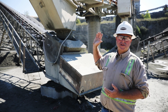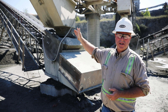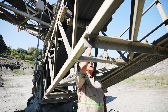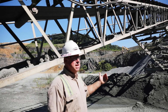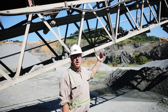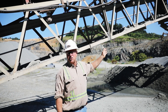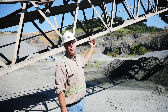If everything's running good and straight the whole way up the belt line and it goes around the head centered on the head pulley, then I walk around underneath and take a look. You sight right up through underneath, looking at the belt line the whole way up. If I see that maybe a few idlers down from the head pulley the belt's walking off, now I know I've got a problem at the head pulley. I'm going to go up and see if the head pulley lagging is worn unevenly or missing some pieces, or maybe the bearing has started to fail.